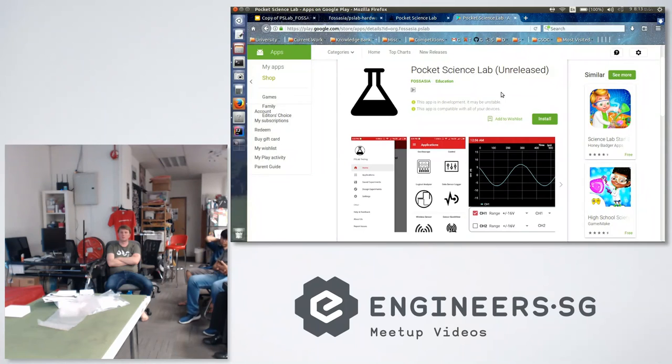If you have someone who does hardware and software, it also shows off the features of the hardware, because it's an oscilloscope and a signal generator. I saw a little bit at the beginning of the presentation that you generate the sine wave and measure the sine wave on the same device. That's a kind of test you should make systematic, and then have software to check that the whole hardware is working correctly. Because once you move to production with 10,000 units, how are you going to test it? You can't just ship it without testing. It's a super important aspect of a project like that.